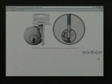So someone who came up with a different idea that's a little bit better is the ASA company. ASA makes a lock called the Twin, the V10 Twin. It's named as such because there's not just one, but two whole sets of pin stacks. You can see this is your main pin stack, and notice this top, the driver is spooled. In fact, really devilishly spooled, and it has an extra lip that catches it. ASA makes very nice locks.